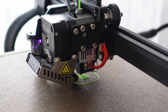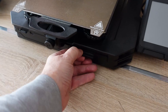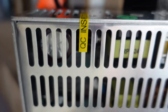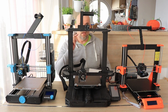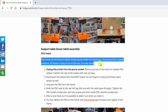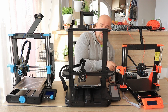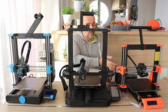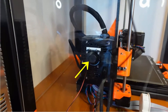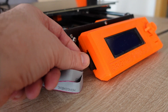The Ender 3 directs cooling air straight from the front. There is a toolbox space on all these printers, but only the Ender 3 S1 Pro has an actual toolbox, which is very useful for storing basic tools. About noise: the Prusa is the quietest because it uses a passive power supply unit, while the other two have a fan on their PSU. However, this is a disadvantage for the Prusa if you want to use it inside an enclosure, since the passive PSU needs outside airflow. The mainboard box also has no cooling fan on the Prusa, so I added a small external fan to keep it cool inside the enclosure.